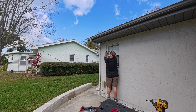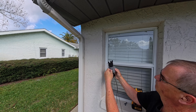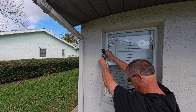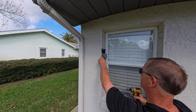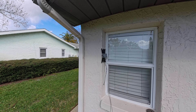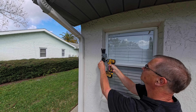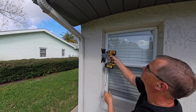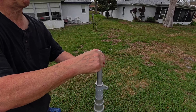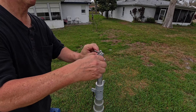I'm using the winder itself as a template for the two holes I drilled. Then I'm going to put TAPCONs into the concrete block stucco wall. The winder has a strain relief, and I've used that while attaching the wire using a wing nut on both sides — one side for the radiator and the other side for the counterpoise or ground radial. I'm letting that radial hang down from the window and drape across my concrete porch. I recently added a ring connected to a 3/8 x 24 stud on the very top of the portamast, so my wire is going to be about 21 feet in the air.